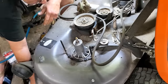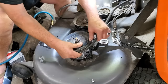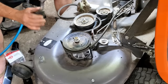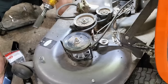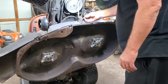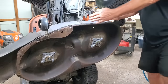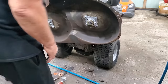Now I've lost my other pulley — ah, there it is. Let's pump this bad boy back on. If you're ever replacing just the belt, these you can generally just walk off like that. They've got enough flex in them, they'll come off pretty easy if you're changing just your belt. Now all we've got to do is put the deck back up here in the hole. Hook the belt back in right there. I had it engaged so that those brakes come back off the pulley — that's why I do that, so that way it's easy to spin.